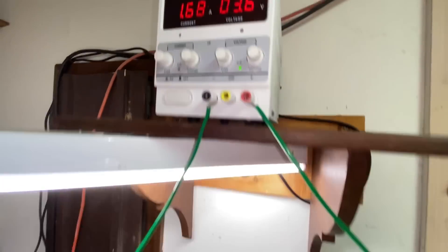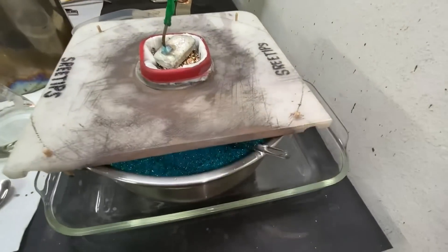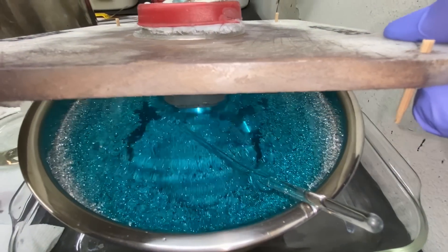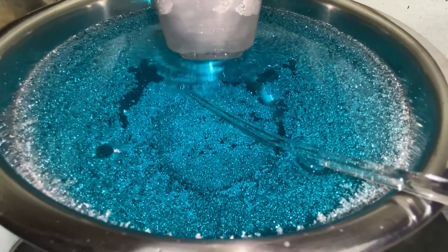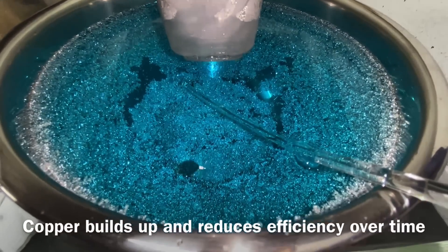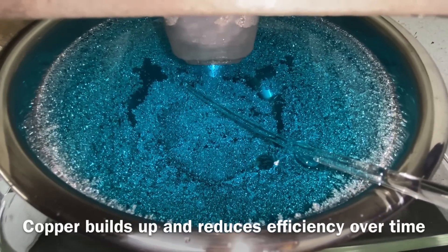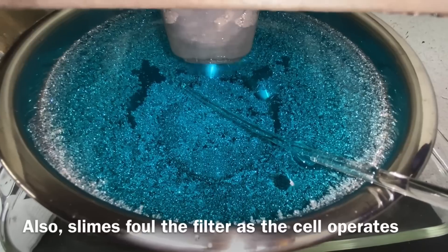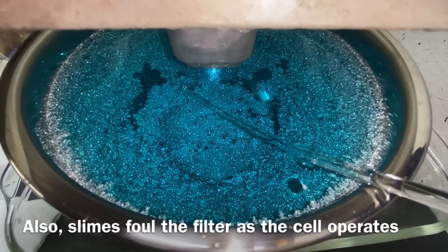This is just under 48 hours in, and we've got our silver cell in good condition now. That's the pure silver plating out on the inside of the cathode — two days worth of growth with fresh electrolyte and a fresh anode filter. The cell works very efficiently and the crystal growth is rapid.